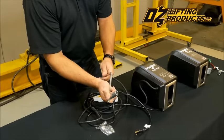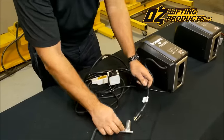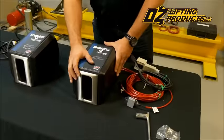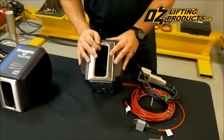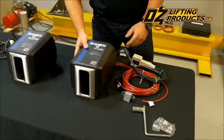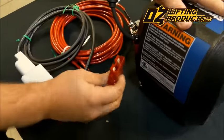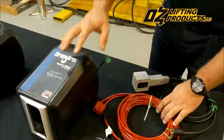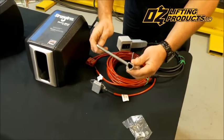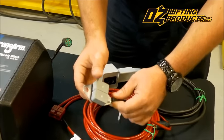When you let go of the pendant, all motion will stop. They also come with an emergency hand crank in case of a power failure, so you can manually operate the winch. This AC model runs on standard 110 volt AC power. The DC version also features a larger inner drum diameter for better cable life, factory set overload protection, a quick disconnect on both the pendant cable and the main power leads so the winch can be moved from the 12 volt situation. It includes the same emergency crank handle, and the DC version comes with a circuit breaker built in for added safety.